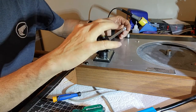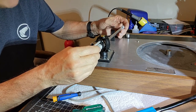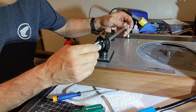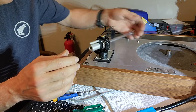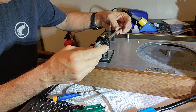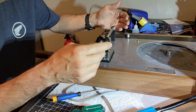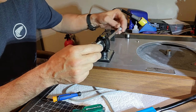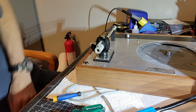So what I ended up doing was I cinched down this top bearing screw. Not too much, but just enough so that there's no longer any play in the bearing. And so we've got really good light left-right motion, very fluid. And up down is good, and then I just hold the thing and notice there's no shake or rattle or anything. Only when it's in here I can make a rattle, but that's just rattling here. So there we go. I think the bearing is really good.